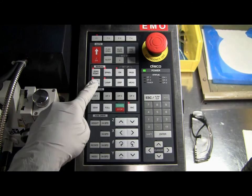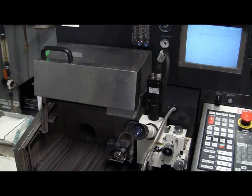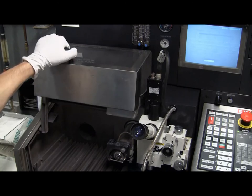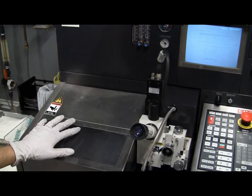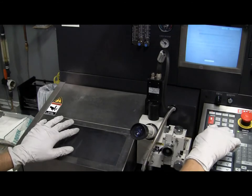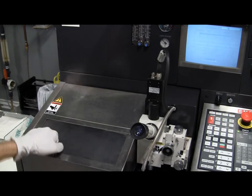Next, turn off the spindle by pressing the spindle button. Once the spindle has fully ramped down, you should hear a loud click, indicating that the safety cover solenoid has unlocked. Close the left safety cover by lifting up the black handle, pulling toward you, and then pushing the black handle down firmly. While holding the safety cover closed, turn on the spindle again by pressing the spindle button. You should hear a loud click again, indicating that the safety solenoid has engaged. Verify that the safety cover is secured by pulling up on the black handle.